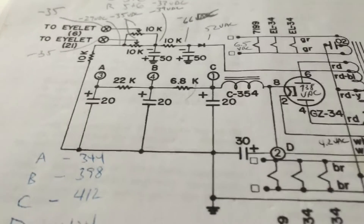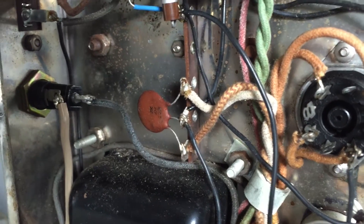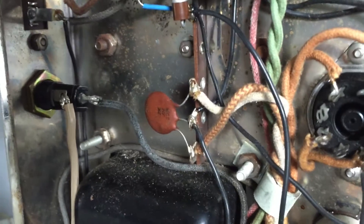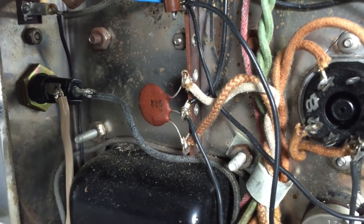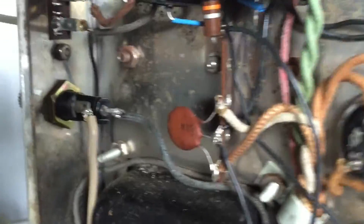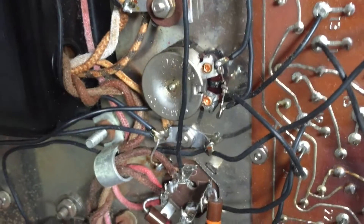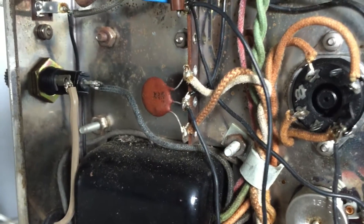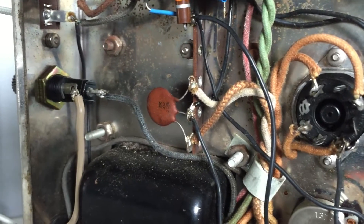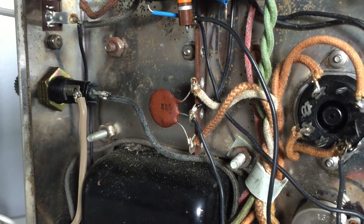These capacitors do not change the sound quality of the amplifier in any way. The center tap of both heater circuits also have a capacitor that connects it to ground. These are AC, about 6.3 volts, and the center taps come off the coil right here. Instead of directly coupling this to ground, which could be dangerous especially if there was a failure in the transformer, it's a good idea to have something in place to allow AC to flow without directly coupling it. This capacitor serves this purpose.